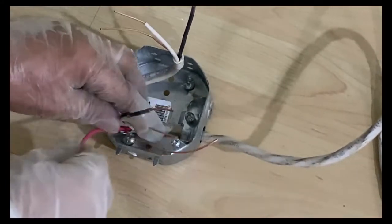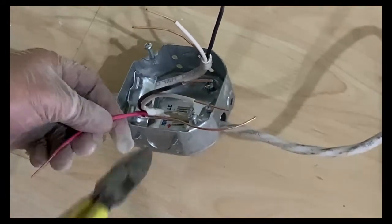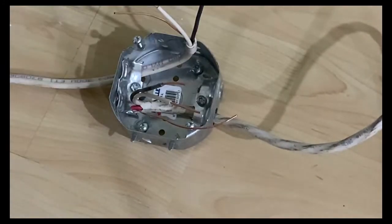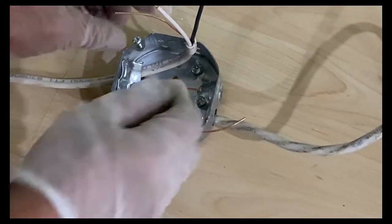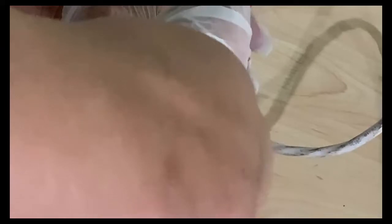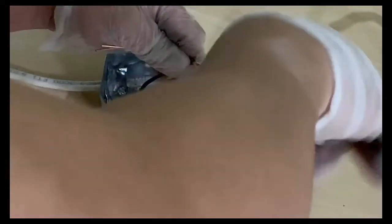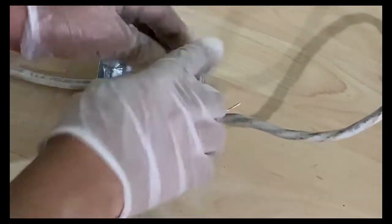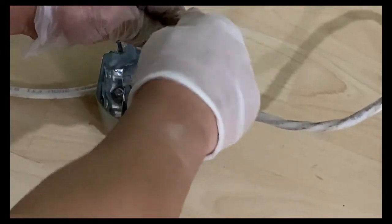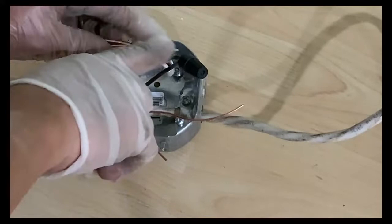When it comes to the power source, you will not be using the interconnect wire for now, so you're going to cut it off. As I mentioned, it will just interconnect the smoke detectors. To connect the first node to the power source, the black wire here will be wired together with the black, and that will activate the entire wire connected to the smoke detector. Make sure you do the proper connection — after twisting and ensuring the connection is ready, wrap it with electrical nuts to cover the active and live wire. Then wrap it a second time with electrical tape.